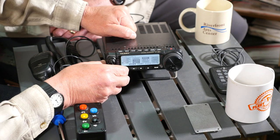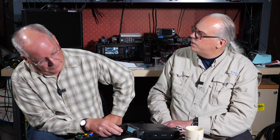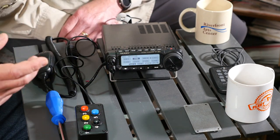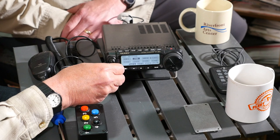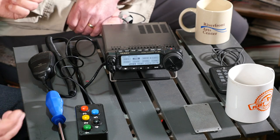So here's how Yaesu handles that — you have to switch to a different sub-menu, the memory keyer sub-menu. I have a video on how to use the memory keyer, so I'll throw a link in the video description. From this screen you can access any of the five memories, but it's not terribly simple. You have to reach this little button and select the one you want. In the heat of the battle — in a contest, Parks on the Air activation, whatever — you don't want to be fiddling with this button, because the rest of the display is taken up by this menu. You'd have to leave this menu up all the time. It's a pain.